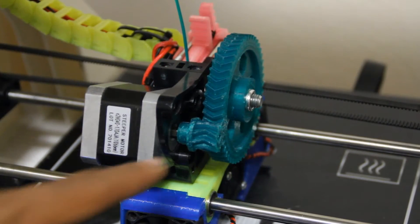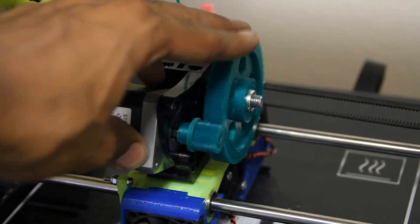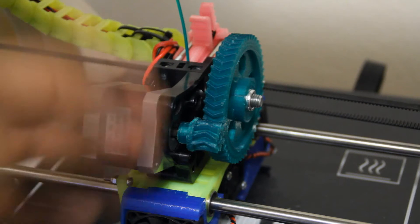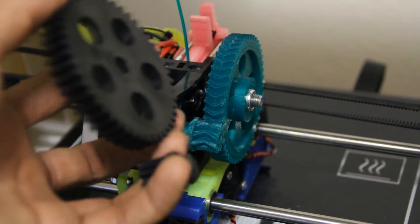I did have to sand the small gear a little bit to get this to work properly. It does extrude and retract just fine without any problems. I did an extruder calibration and it actually matches the exact same steps as the old gears, so I didn't have to do any major calibration. This isn't a print-and-stick model — you can't just print it out and jam it onto the extruder and expect everything to go well. You might have to sand the extruder gear for about five to ten minutes in order for it to fit on your extruder properly.